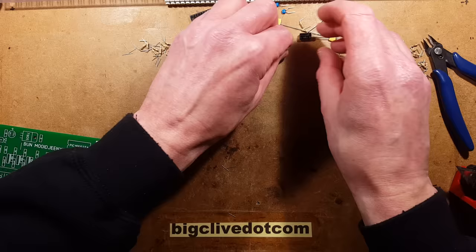I'm going to turn this over and solder the middle pin of each MOSFET, switching back to the thin solder for more control. I'll then adjust them to make sure they're all completely level. You should also make sure to test your test lamps every time you test them — prove they're working, ideally on a known live source before and after you test for dead. Although that doesn't always happen when you're nowhere near a potentially live connection. Some of the rules and regulations in the UK are very odd — they're not based in reality.